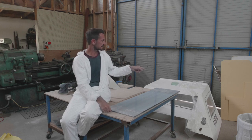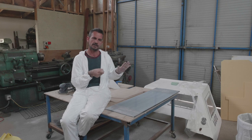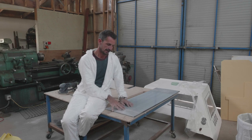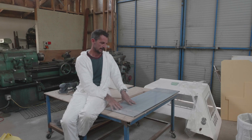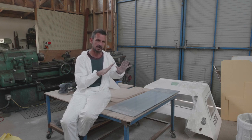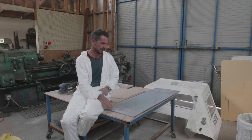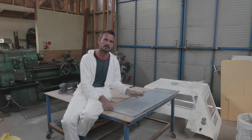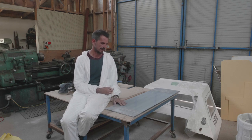Acrylic is really great stuff and we used it for the previous windows. It's hard — you can't bend it, and when you're drilling or cutting it you have to be quite careful as you can chip and snap it easily. It has good scratch resistance, better than polycarbonate, but it's more brittle. This polycarbonate I could put in a sheet brake right now without heat and actually bend it into a right angle. Its flexibility makes it really tough — it can absorb shocks without breaking, and that's what we want in a dodger in case a big wave hits it. Waves don't scratch that much but they certainly transfer impact. We just have to make sure to wash off salt crystals before wiping the windows. It's just a bit less scratch resistant than acrylic, but it has other attributes we really like.